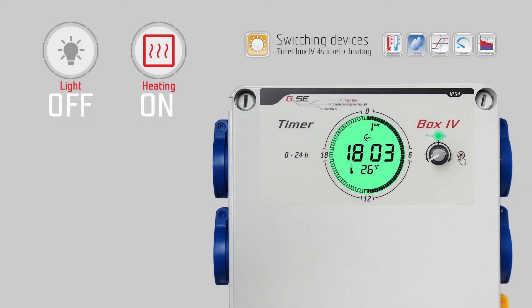To enter the settings menu, push once on the encoder. You arrive at the return function — push the encoder to go back to the main screen, or turn right to go to the day counter setting. Push the encoder so the value starts flashing, then turn right to increase or turn left to decrease the value from 1 to 99 days. Every day at 0 o'clock the day-night cycle will count plus 1 day. Set the desired number of days and push the encoder to save.